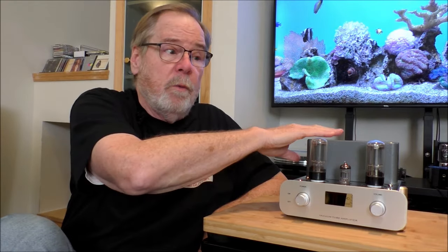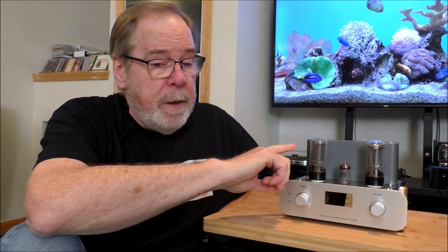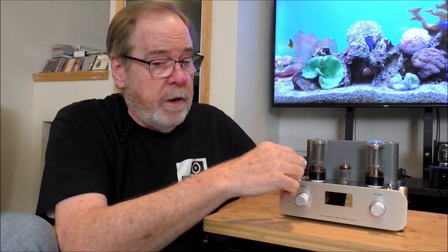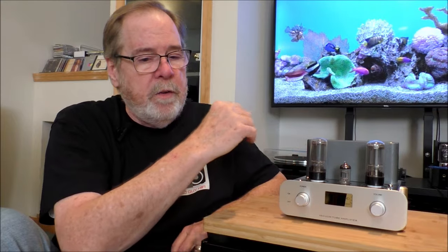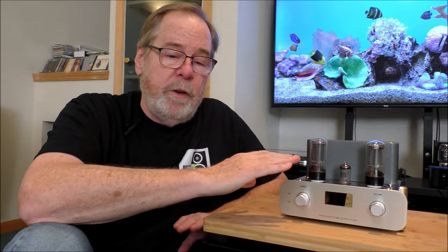You could run these tubes at a higher wattage, but there are limitations on the transformer. The 6L6 is actually a beam-powered tetrode. In this type of tube, the design includes a beam-forming structure that helps focus electrons from the cathode to the anode. There are plates that transfer power from one end of the tube to the other, improving efficiency and performance. While it has triode-like features — cathode-anode plate, control grid, and two beam-forming plates — the configuration allows for higher power and better linearity, which is why they're using it here.